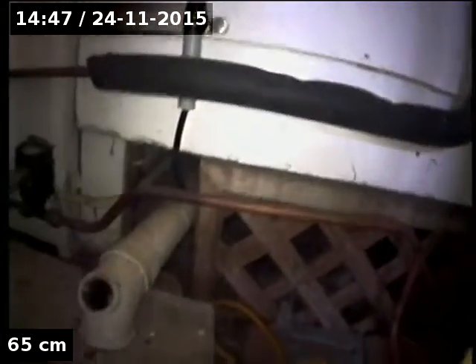So I've just been all around the house and checked everything else out. There's no other underground drains — they're all at this side, so I've pretty much been through the length of them. But what I did see while I was around there: this pipe here leads back to the kitchen and looks like it's got a sag in it, so that will probably cause some issues.